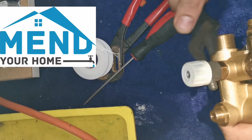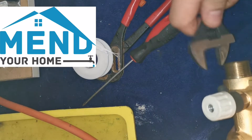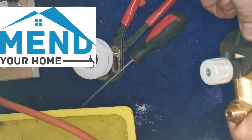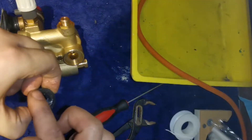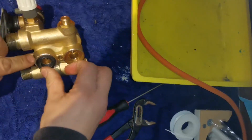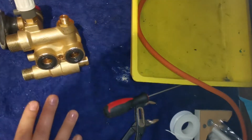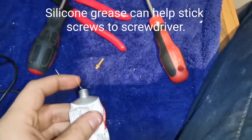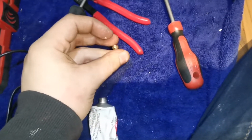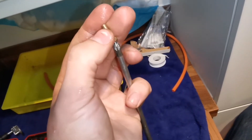Then you just nip it up and put the drain off on. You have to angle that so it's facing down, so put it up to the boiler and imagine where it would go. Tighten up the allen key. Lube up the washers that go onto the plate heat exchanger — they help keep it in and also let it slide onto the plate exchanger without falling out. Then to stop the screw from falling out I use a bit of silicone grease on the screw, chuck that on the screwdriver, and it just holds it in place — it just won't fall out.